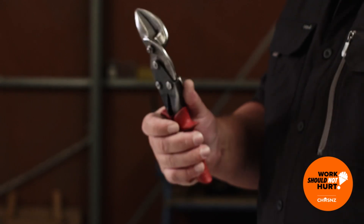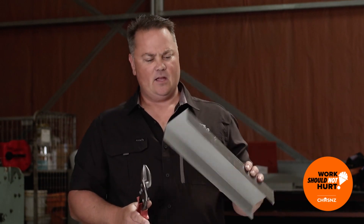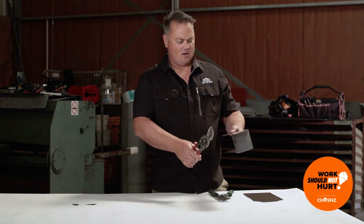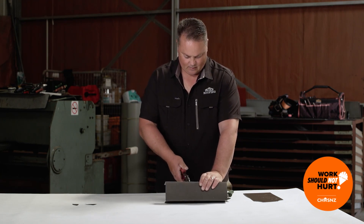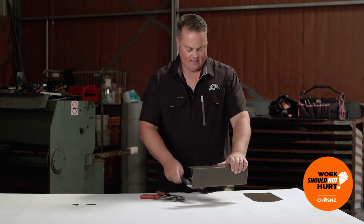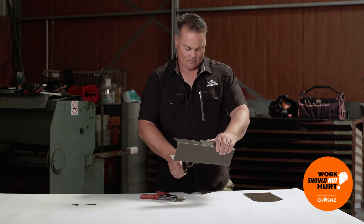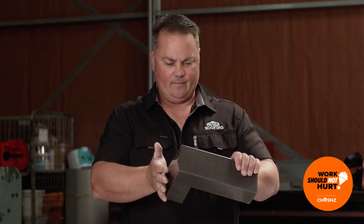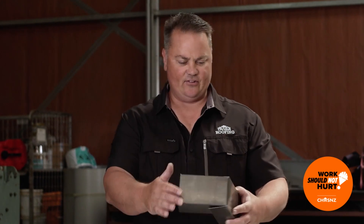The other reason you use them is the way the jaws work - they'll push your offcuts or push your material a certain way that you want to go. So if I'm going to fold this down and I knew I wanted this material underneath this side, I would use the reds, push the material under this material, and then come and use the greens - push the material under this material and it'll fold down. My material's gone where I wanted it, and the snips help that.